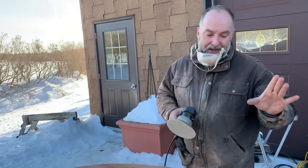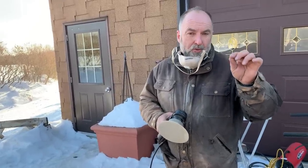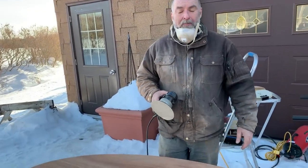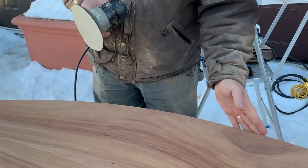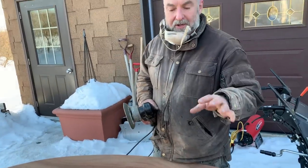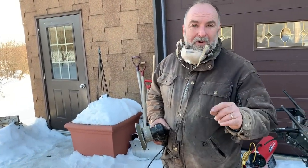One of the things about finishing a tabletop: I never use a random orbit sander on the tabletop surface, because the action of the abrasive is swirly and it will leave swirl marks behind. You won't see them until the finish goes on, and then it'll be too late. I'm just going to refine the edge a little more with this random orbit sander — there won't be that many scratch marks on the side, and it's not that prominent. The surface of a tabletop is so prominent that you have to be very particular.